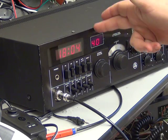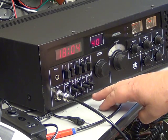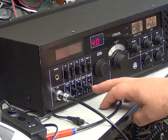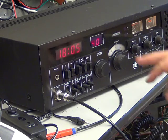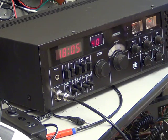You've got a SWR meter built in. The clock can wake you up in the morning with CB, and you've got a sleep countdown timer and a dimmer for the clock. Channel — that's a delta tuning, so it's a clarifier. RF gain, squelch, SWR set for the built-in SWR meter, tone control and volume.